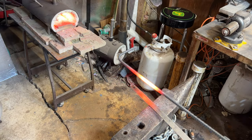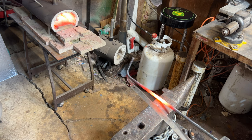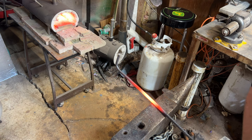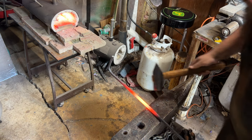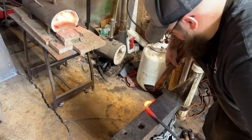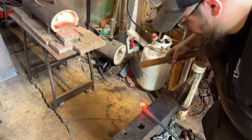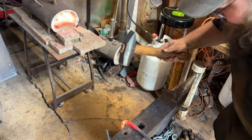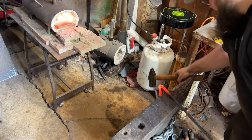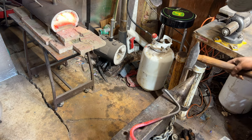To put in that second bend, I have my ruler set up on my anvil so I can measure out that 12 inches, and then I do the exact same thing as last time — hit it on the cooler piece of steel to try to add in fewer wobbles and bends. Here you can see I didn't quite succeed with the first couple of hits and there's just a little bit of extra bend in there, which is why I'm straightening it out and spending a little more time, which isn't really that efficient. So try not to do that.